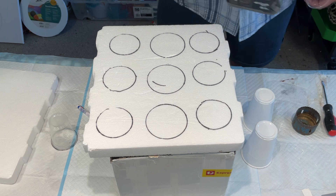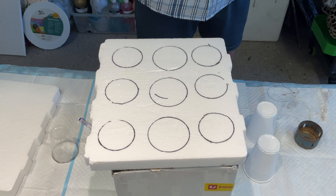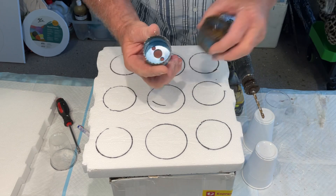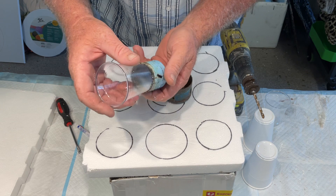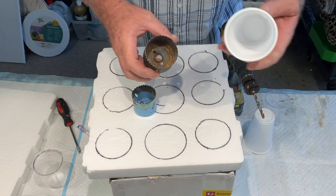I've marked it out roughly. Now the hole saw — can you show them the hole saw? I've got to pull that apart to show you how I've worked it out. You separate it and this thing screws off. I've worked out the bottom of the cup and this hole saw is just slightly larger than the bottom of the cup. When you cut it, it'll actually go a little bit wider than the hole saw as well because the teeth stick out. This one here is the closest I could get.